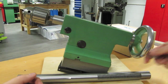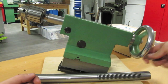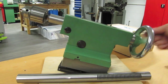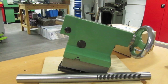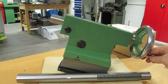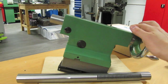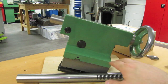The way the piece of tooling is extracted is by using the power of the thread to drive it out — you can see it popped out there because the thread bumped it. You need a relatively light force to disengage the two tapers, whereas it takes an incredible force to make them slip on each other, which is why taper tooling is so beautiful. In use, it would be very irritating if the tooling slipped out of engagement while drilling, causing the chuck to spin in the female taper and cause untidy engineering problems. It's pretty tedious to drive the hand wheel forward to drill, then back again to clear chips, and forward and back again. It's what they call a first-world problem, but it can become tedious if you're drilling lots of holes or have a lot of tailstock work to do. And that's what this upgrade is all about.